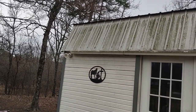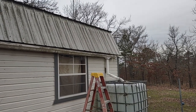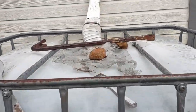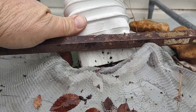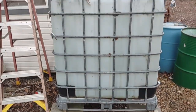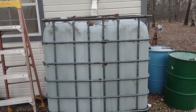This system I built about six years ago — we put some Home Depot gutters up here. This is a 16 by 40 cabin so it's got a lot more gutters — about 80 feet of gutters. The water level is completely topped off in here, all the way to the top. The water runs down on this side and goes into a 330 gallon tote, which is completely topped off and full. It doesn't take much — just an inch or so of rain to completely fill these up if they were bone dry.